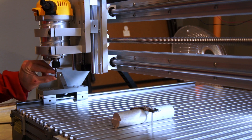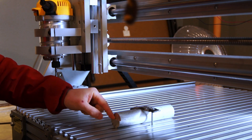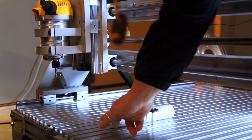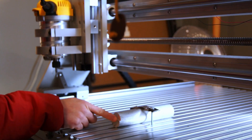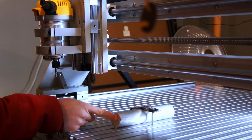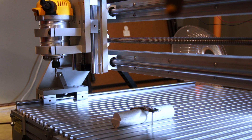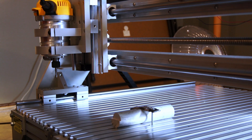Tool engagement was a bit high on that one but look at that. Nice — it's not pretty. It's really got a lot of chatter on it, but it held the chatter up to about right here, so it looks like you can probably go down with that depth of cut. That depth of cut probably shouldn't have gone below like .4 or .5. How fucking cool is that? It fucking works. It wasn't beautiful.